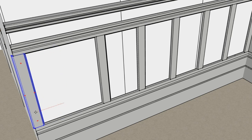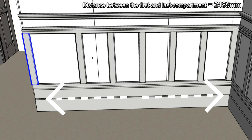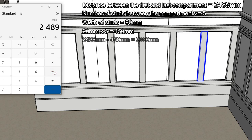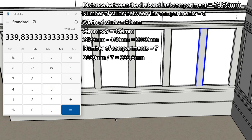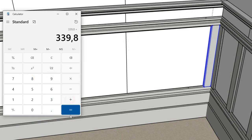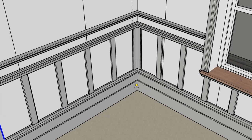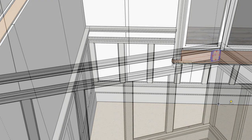To calculate the correct distance between the compartments on a wall, you can do this: measure the distance between the two compartments on each side of the wall; count the number of studs between the compartments; measure the width of your studs and multiply that by the number of studs; subtract the sum from the total length between the compartments; divide the sum by the number of compartments. The exact distance between the studs will be 339.8 mm. If you add the width of the stud to this measurement, you can use it as a CC or OC measurement, and the sum will then be 429.8 mm. The compartments can be approximately 5 cm different width in each direction without it being visible.